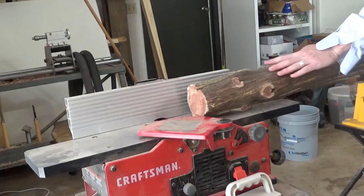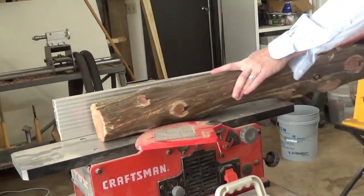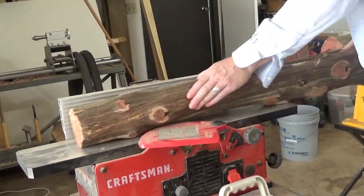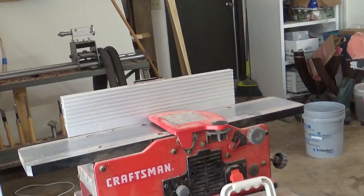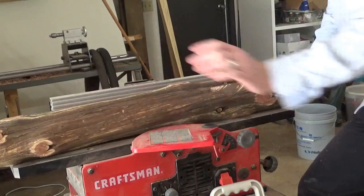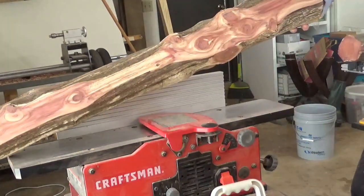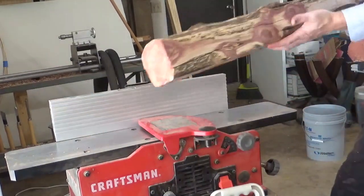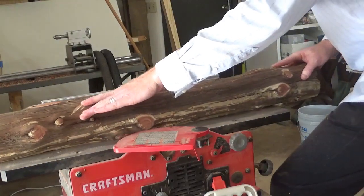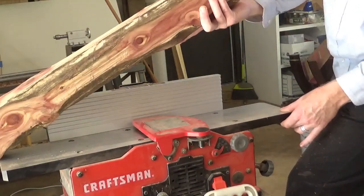Don't really have a good way of doing that except shave off a few slices, try to make it as flat as possible on the surface, joiner, and then plane it down to a square. It works okay for pieces under, say, 6 inches square, but anything bigger than that, and it really doesn't work well. I would need a bandsaw or something to do better than that. But I really only need small pieces anyway.